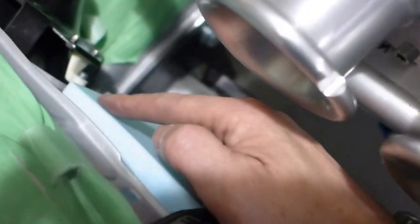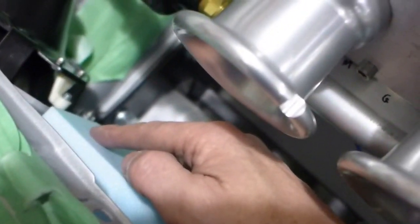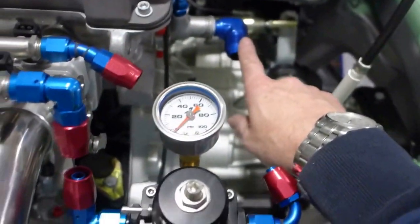and it barely clears the underside. The fitting is going to come underneath here and then out and then to this corner up here on the radiator. And then there's the number 12 line that runs from the other side of the cylinder head, and that'll come through and underneath, and just underneath this number 16, it'll go. The number 12 will go there.